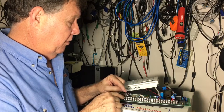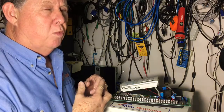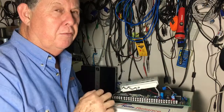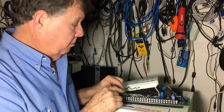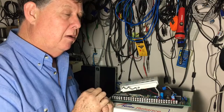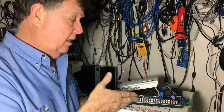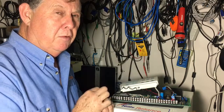One of the advantages of this is if you have a single 4-core cable run going out to a detector somewhere with two detectors hooked up on it, you can put a different value resistor in each detector and report them as different zones, which is better for fault finding and reliability. To recap: the 3.74K resistors are the lower zones, that's zones 1 to 8, and the 6.98K resistors are zones 9 to 16. This is how zone doubling works. Hope this has been useful — thanks for watching.